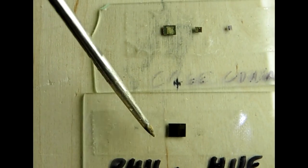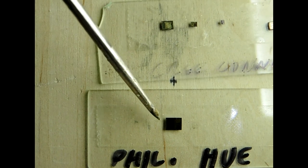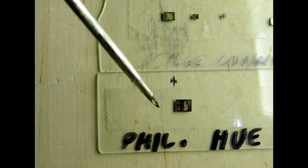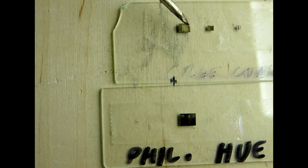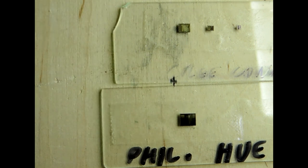To be fair, the Philips bulb is a bit newer than the Cree connected. What's also really interesting is that the Cree connected uses an ARM 32-bit M0, which is a tremendous processor, while the Philips uses the AVR, which is an 8-bit processor. I was kind of expecting the Philips die to be a bit smaller because of that, but you can actually see they're almost equivalent in terms of area — once you combine those two rectangles together you'd end up with the same circuitry. So there you go: a world of technology in all these Zigbee bulbs.